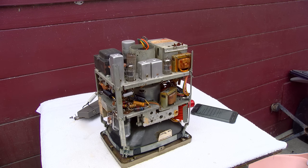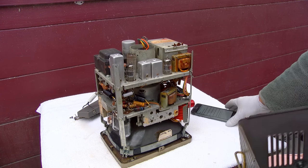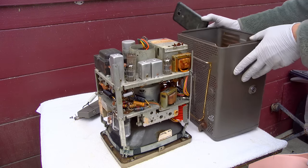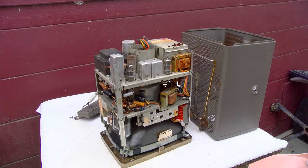All right, wow, just for reference, let me read how the SAMS says to take it apart. Remove two knurled screws at the sides of the cabinet, remove 7 push-on type control knobs, remove 3 screws holding cover and case assembly. I didn't see those. Take off the carrying handle by removing the 2 metal screws. Remove 1 metal screw at the bottom front of the cabinet.